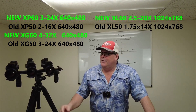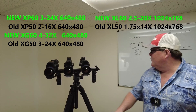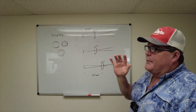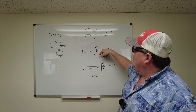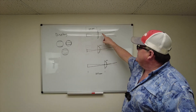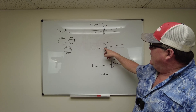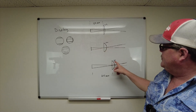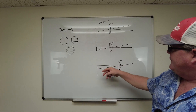By moving to the 60 millimeter lens up front, they have been able to increase magnification in the units. Looking at the board here, in the case of the previous XP50, they had been running a 2X at 50 millimeter focal length. When we add more curve to the front of a lens, it decreases the exit pupil or the angle coming out the back. If we stayed at 50 millimeters and wanted to go to 3X, it decreases our exit pupil and we wouldn't be hitting the entire sensor. By pushing it forward to the 60 millimeter, it gives us a little more distance to let that cone get bigger and hit the entire sensor.